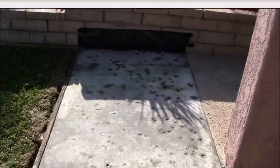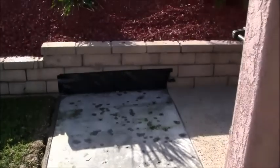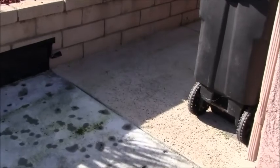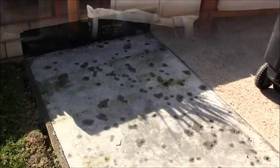The greatest issue that I had here was that I used the wrong salt pellets. I'll show you that right now. Before I show you that, this is the look that I should have been going for. Let me zoom in on that. That's the salt finish I was trying to achieve. You see all the small recesses and the number of recesses. If you compare that to my slab, my pellets were way too large, spaced way too far apart, so there's no way I'm going to achieve that look of that salt finish with my technique, and that's because of the salt pellets.